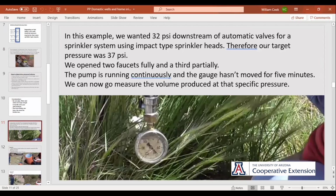And while we're at this part, I'm going to talk about that 20-pound fluctuation. If your well is cycling on and off, and having already looked at that data sheet for sprinkler nozzles, this applies to everything: emitters, soaker, you name it. At a lower PSI, your flow rate is reduced. So if your well is going on and off, you might be over pressuring, say, a soaker hose and blowing it out at the point where the well is going to shut off. Or as the pressure goes down when it's not running, you're going to lose water pressure.